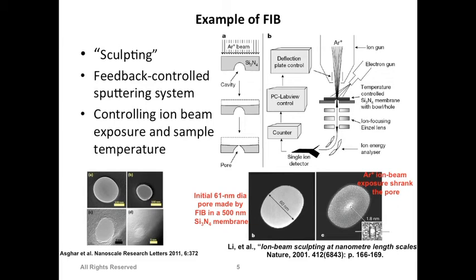A similar thing happens with the scanning electron microscope (SEM): we shower electrons on the surface, secondary electrons are ejected and detected by a detector. The pattern of electrons from different areas builds an image - the software makes an image based on the amount of electrons coming from different areas. However, when working with bio samples like human cells, which have proteins and polymers on the surface and are not fully conductive, there is a problem.